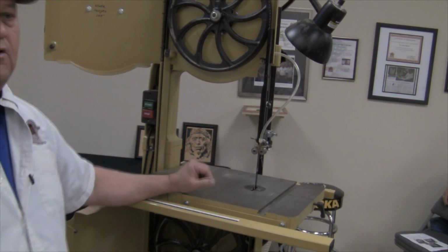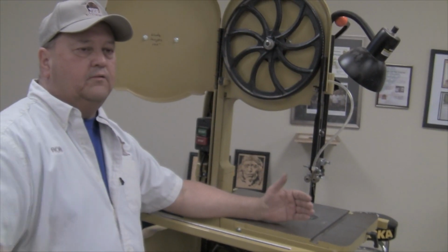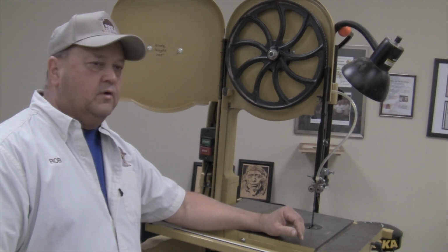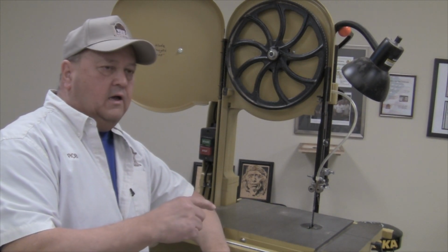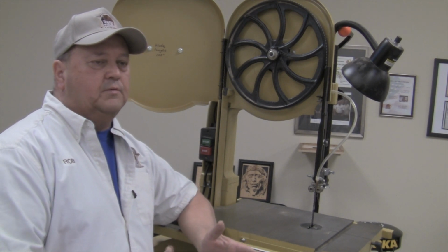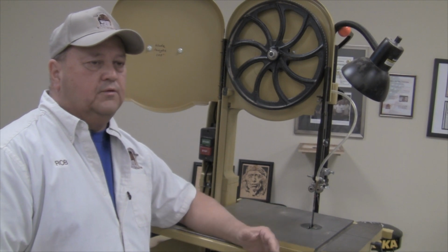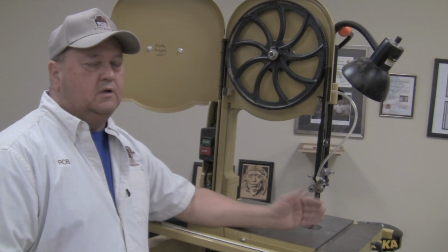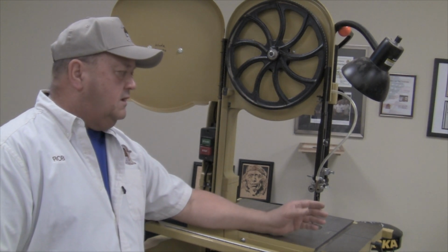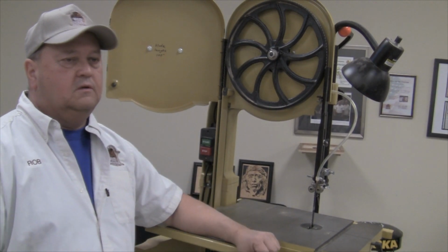And there's nothing wrong with doing a 4 foot board. I've done plenty of things that I've cut with that, or taken a 1/4 inch off of a long board. We've had some that were a 3/4 inch board that was about that high, and we took it down to 3 different boards and divided it up as close as we could. You're going to lose a little bit out of the kerf, but from a 3/4 inch board, you get a little less than a 1/4 inch, and you get 3 pieces out of it, and you cut that nice and smooth. The biggest thing is having a blade where the teeth aren't messed up, they're all nice and straight. You can cut it with no problem.